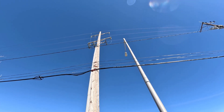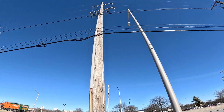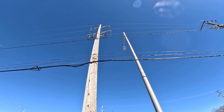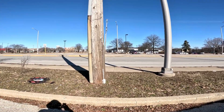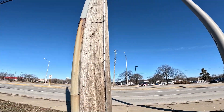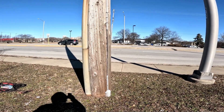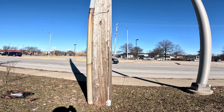Make sure that ground is all the way connected into the cable up there, connected to the ground inside the cable, and it comes down this wire all the way to 10 feet into the ground — grounding out this pole in case this cable has any issues. If it starts acting up, the force of the electricity will go right into the ground, down 10 feet, versus blowing up and catching the pole on fire. That's why you never want to peel back the ground — it's on the main cable. Somebody can peel back the ground here, but you should never touch that, because if anything ever happens to that cable and you're touching that ground, you can get lit up, energized. You don't want that.